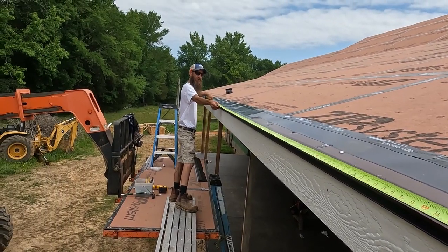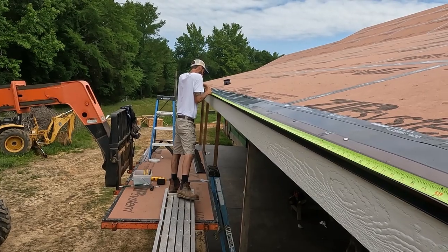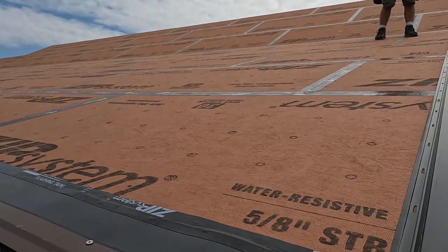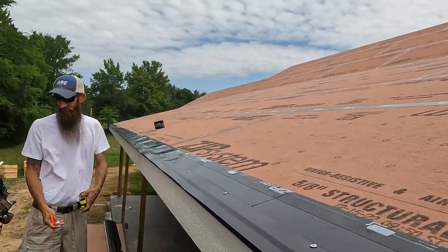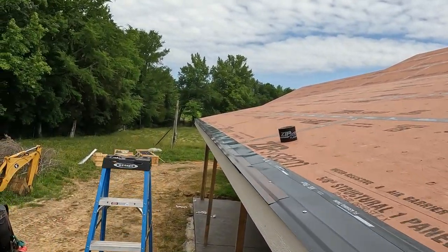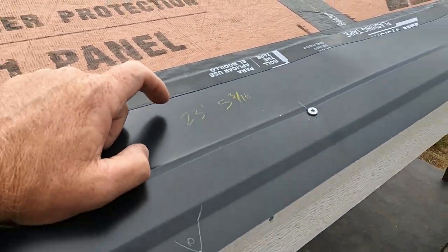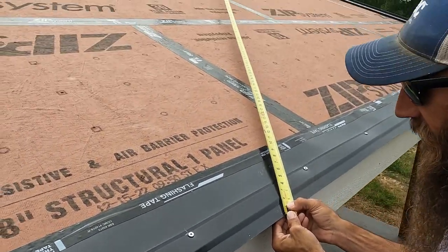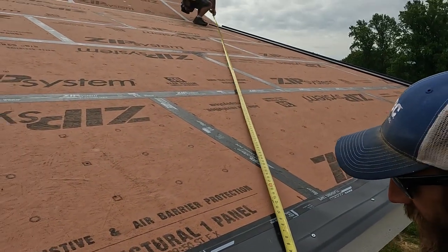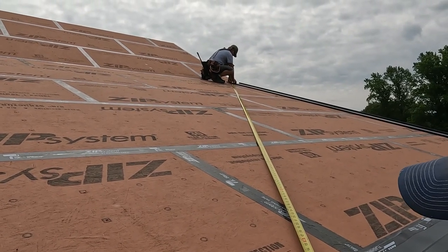Brent's going to measure 15 feet right to the very bottom edge. Steve's got 18 feet, and I'm going to get on my Construction Master Pro and we'll figure out what it is. So my diagonal measurement is 23 feet 5 3/16". And you'll be right to the, you're nailing right to the edge at your 18 foot mark.